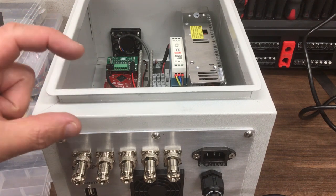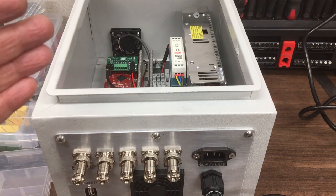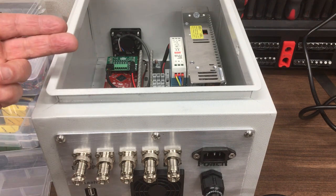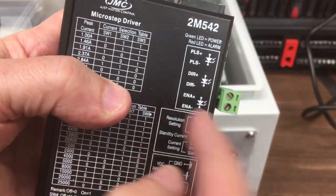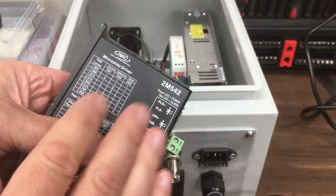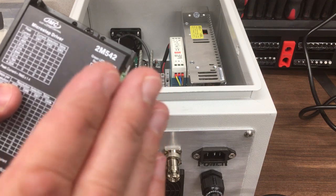Let's talk briefly about the emergency stop. What I've ordered is a standard mushroom-head emergency stop button to go on the front of the lathe next to the control panel. The idea is that if something goes wrong — it's threading too fast and heading for the chuck — I want to be able to stop the servo dead and have it not restart when you release the button. If you've got a stepper motor you could use the inhibit function, but the problem is that as soon as you release the e-stop, if the spindle is still turning the system will still be outputting pulses.